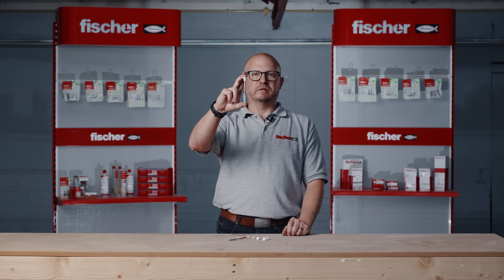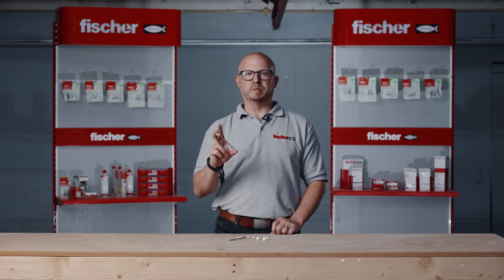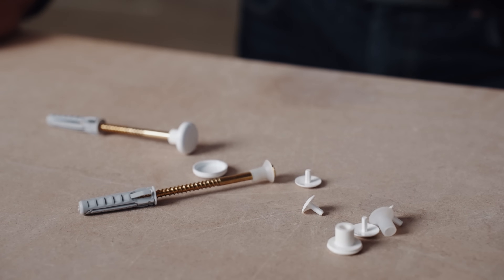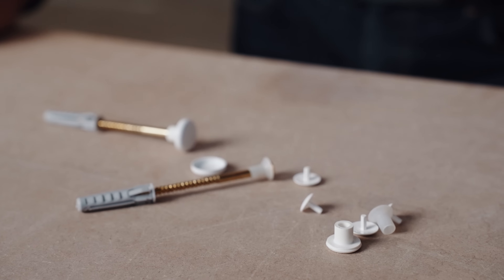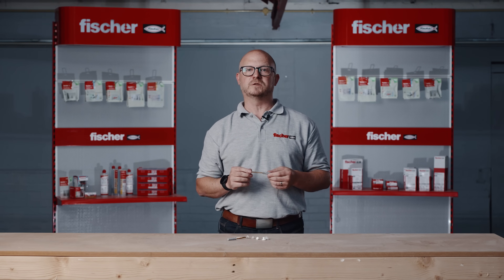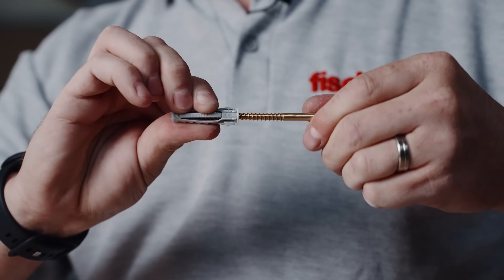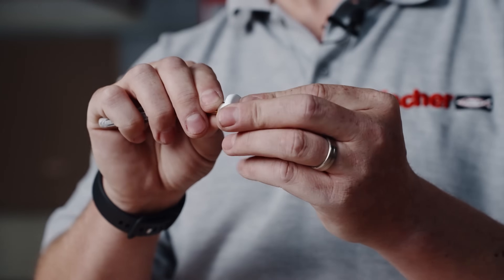The WB10 is for vertically fixed toilet pans and bidets. It comes with SX Plus plugs for concrete floors but can also be directly screwed to wooden floors. It also comes with a variety of nylon bushes and cover caps to accommodate different hole shapes and sizes. When installing, mark out the position of the toilet and screw directly into the wooden floor, taking care to avoid any pipes underneath. For concrete floors, drill and plug the floor prior to screwing down using the screws and washers provided. Finish the installation using the screw covers.